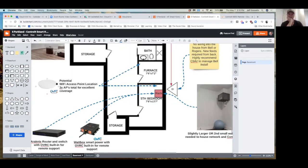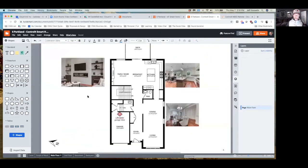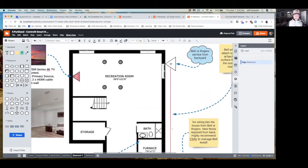I've quoted three access points: one on the ceiling near the rack in the basement, one on the main floor, one on the second floor. If the main floor one can't go in that hallway we'll probably put it inside one of the cabinets so it covers Wi-Fi back there — you've got cables in that cabinet behind the TV area.